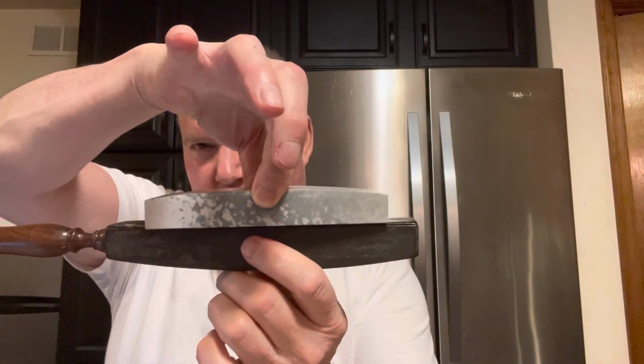So the first step would be to use the super curve. And this is the ancient super curve. So the first step would be this, okay? And then the second step, unlike the procedure outlined in the German Grinder's Handbook, they go directly to a flat. Because I checked the other sides of this, and this is a flat reference. I've not done anything to this. It's as it comes from Dan's Whetstone, okay? I don't have a straight edge, but largely you have 3 sides that are flat and 1 that is the super curve.